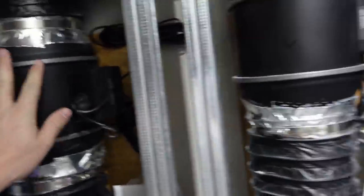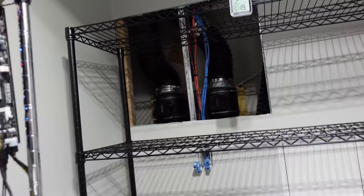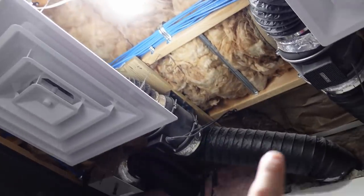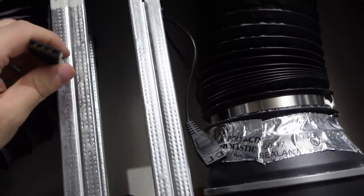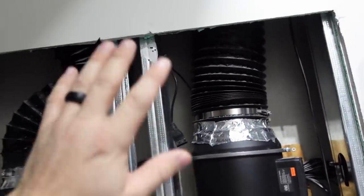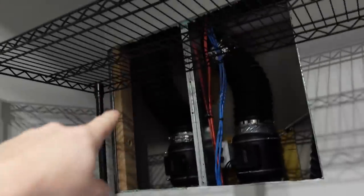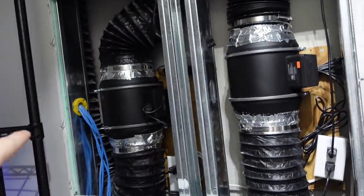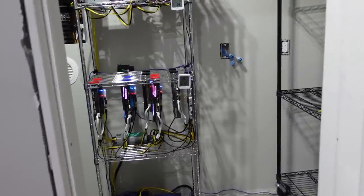The fans that are currently unplugged are at full speed. I'm going to go ahead and install the smart controller here — this won't be its final spot; I'm waiting for a custom access panel to come in. I got it installed quickly. Something interesting: we're at 98 degrees up here, 89 degrees in the middle, but 75 degrees at the floor — so from the ground to the ceiling is a huge temperature difference in this room.